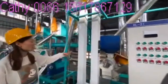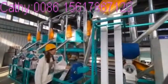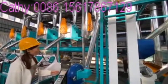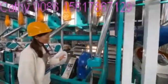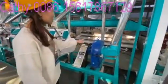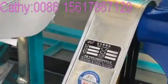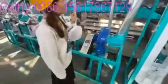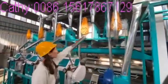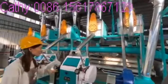After the peeling machine, the material goes into the crusher. This crusher is for crushing the big size maize. After this, the material goes from the crusher into the brusher, then you can pass it into the next part for the roller machine.